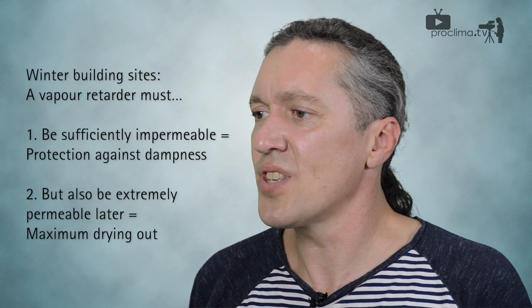That would cause damage. What you are referring to is a relatively short period of time, but nonetheless an important one. Anyone who has been inside a building just after screed has been installed or the walls have been plastered knows the feeling — it is like being inside a dripstone cave. It's very damp. You can see condensate on relatively cold surfaces, such as on the window frame. There are drops of moisture everywhere on building sites in winter when it is cold outside. Water starts to drip and run off when it gets too much. A humidity-variable vapor check must also offer protection against moisture penetration under these conditions.